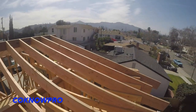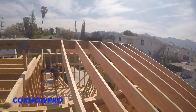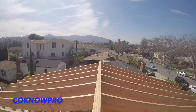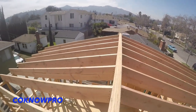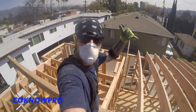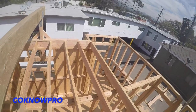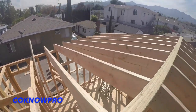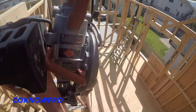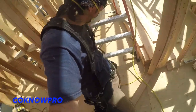All right everybody, there it is — we got all those roof rafters hung, well half of them anyway. Hope that gave you a little insight on how to install roof rafters solo. You saw how we had all our rafters pre-cut, put them up on the exterior wall, walked them up the ladder to the center ridge, and tacked them in. I love doing framing like this. It's one thing to do it solo, but always work with safety — I always recommend having someone around to make sure you're safe and to be careful doing any work like this. Please remember to subscribe, like, and share us on social media.